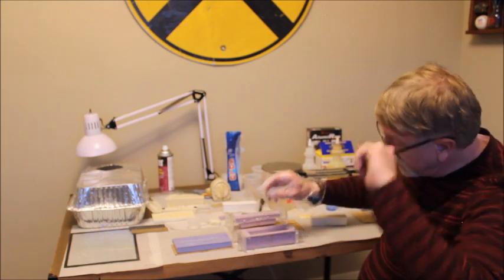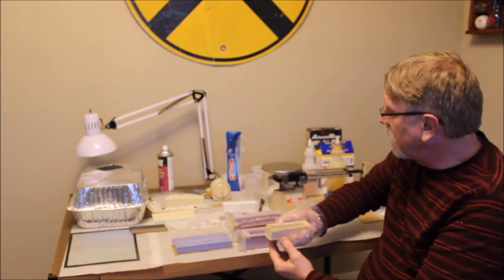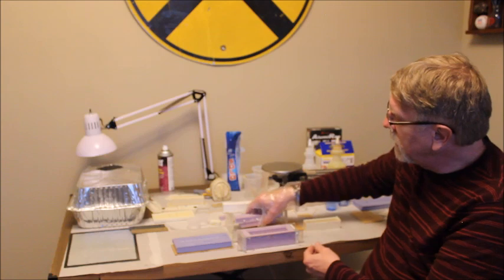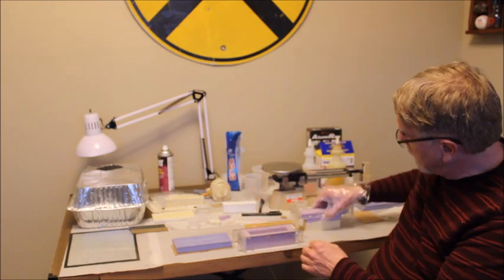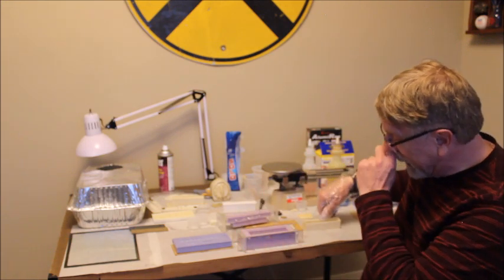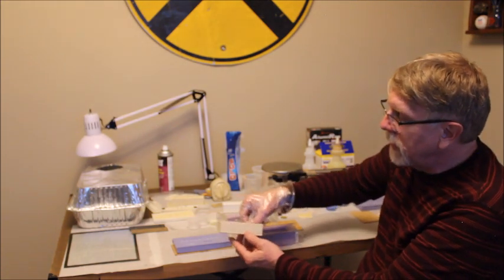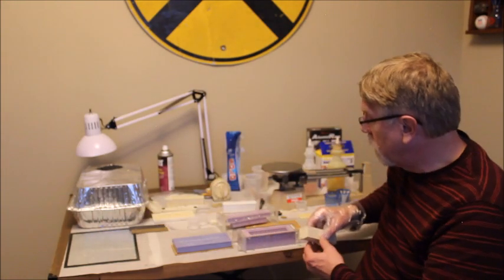Normally, if it's got large undercuts, that means it's going to warp the casting, so then you have to get it straightened out. One way to do that is to take the male portion and put it into the center of the casting, and that will cause it to reform itself. Otherwise, you have to carefully get it lined up and then let it sit someplace to cool.